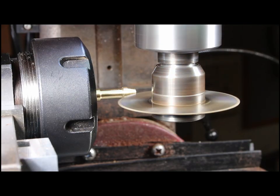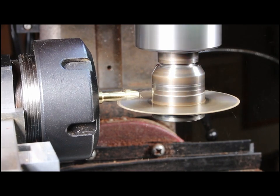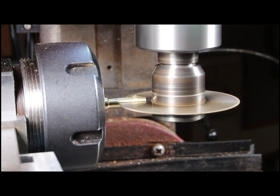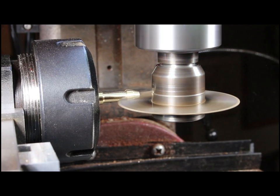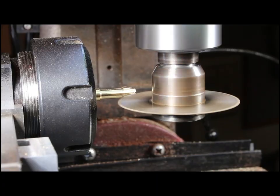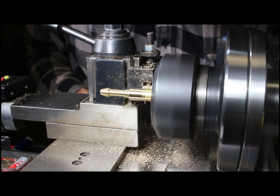Now over to the milling machine. I've got an 0.025 slitting cutter — my favorite cutter with the mandrel I made myself. I'm going to slit all the way through. I've already figured out the depth and it goes pretty far back in there, just like the Dremel collet does. On the second pass I'm doing 90-degree passes to form a nice X. The neck worked really well and looks really pretty. I'm reducing the diameter slightly for the threaded section.